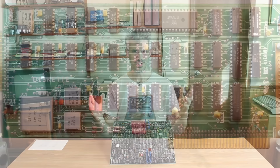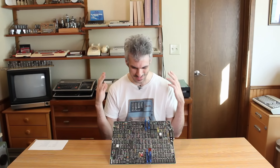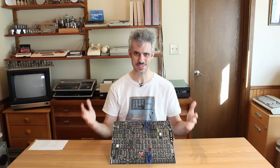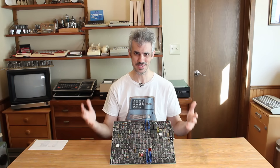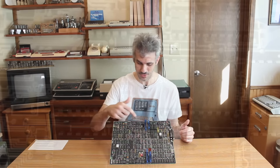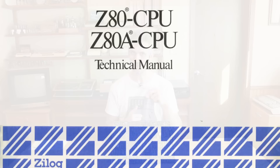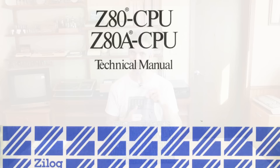In 1986, five-and-a-quarter-inch disk control boards were about half or a quarter the size of this thing — this thing is absolutely massive. Looking at some of the other ICs on here, I think there's more going on than just a disk control board. Notably, we've got a full-on Z80 CPU right here, and while using a Z80 CPU for a disk controller is not unheard of, it does seem a little strange.